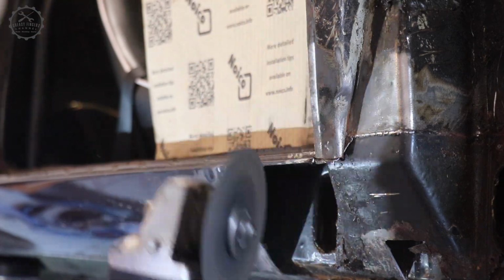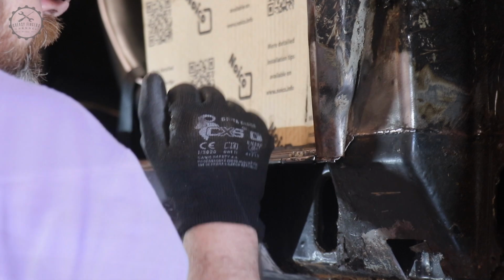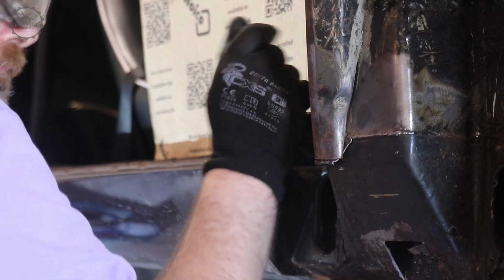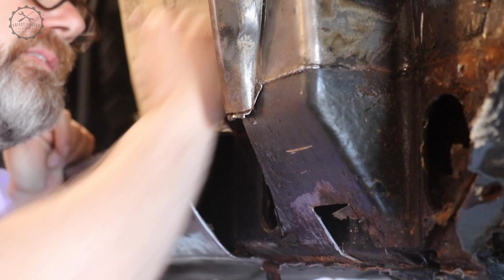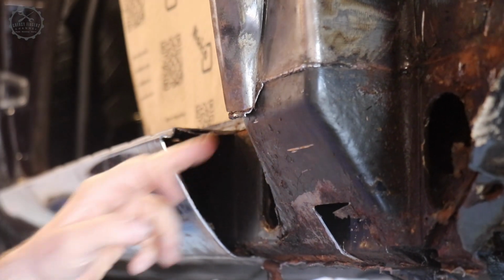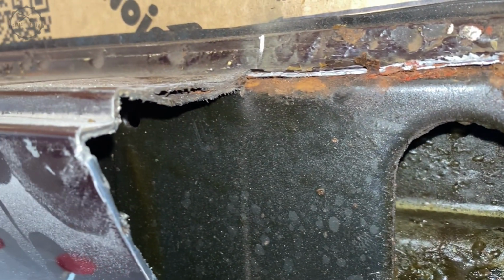The fender trimmed and all the said remainings of the outer sill removed, Johannes wanted me to go step by step and save as much as possible of the sill's alleged original substance, and so I only cut out a hand's width to start. What everybody knows somehow, but only a few are ready to accept, there is no such thing as an original GT sill.